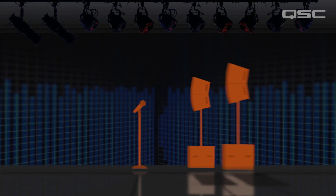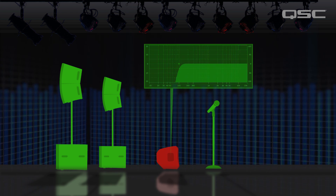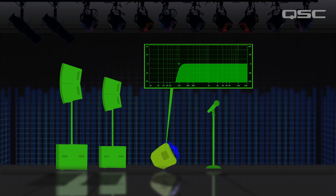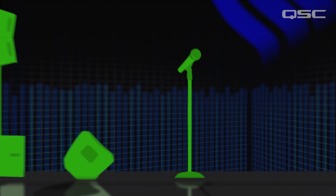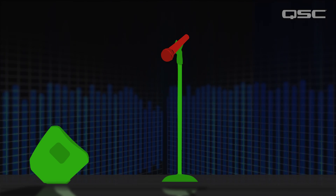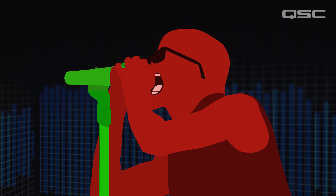Here's a few tips to deal with these factors. First, the main PA loudspeakers should be forward of the microphones. The vocal stage monitors should usually have low frequencies below 100Hz rolled off, and should be aimed at the performer's ear level. As for the microphones, try to keep the microphones pointed away from the monitors, and try to avoid cupping the head of the microphone with your hand, as this causes feedback as well.